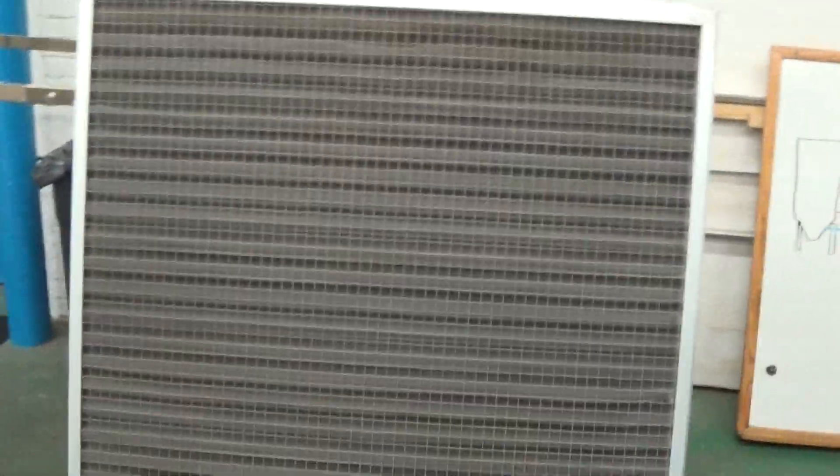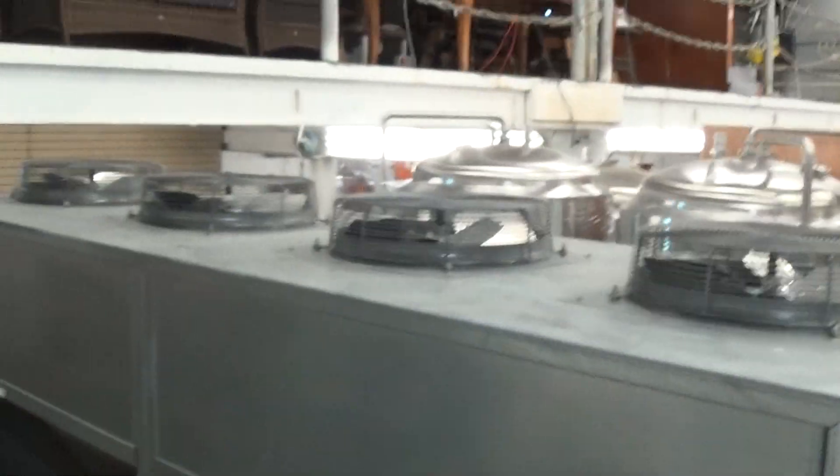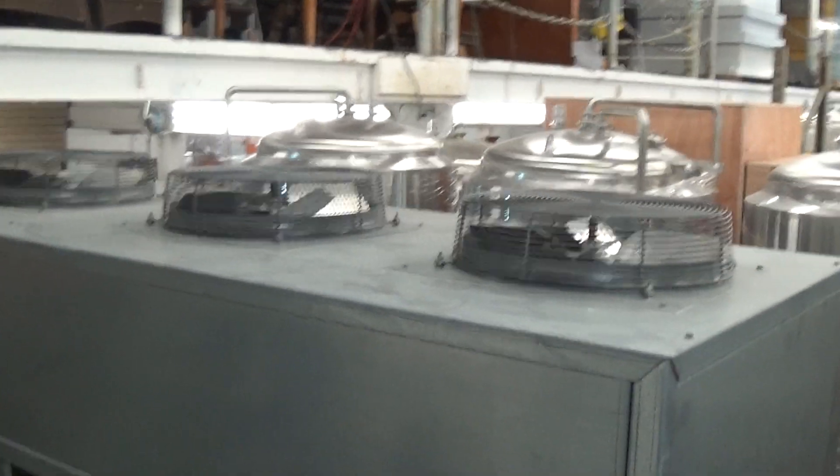These panels on the back side need to be on for proper airflow — you're drawing air from the opposite side and sucking it up through the coils. On this side you have washable filters to prevent dust or dirt from getting into the coils, which are much easier to clean than the coils themselves would be. There are four fans total: two are on speed control for low ambient, and the other two are cycled on and off at full speed as needed.